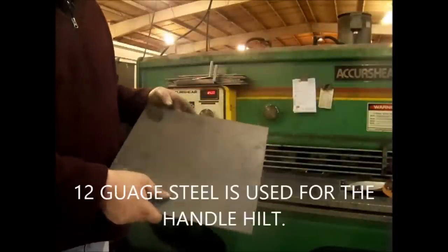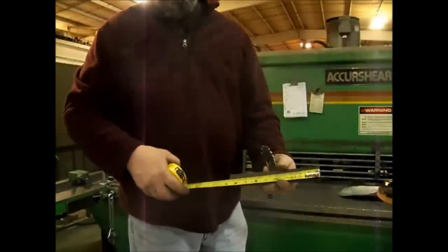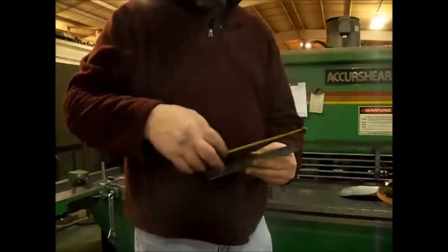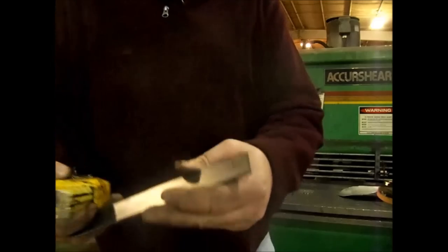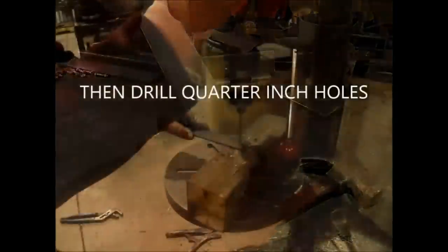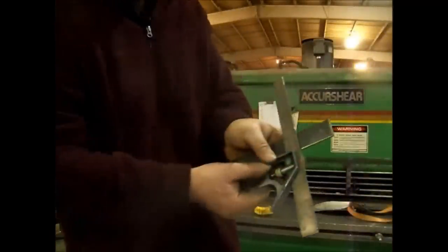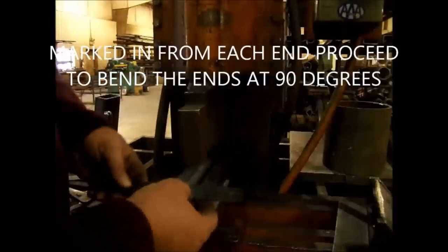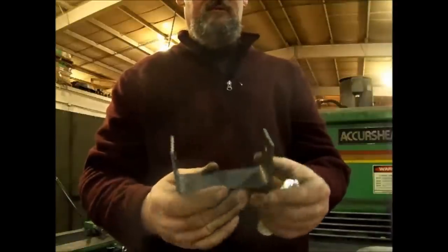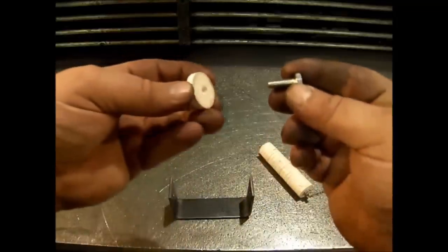What we're going to do next, we're going to cut this piece of 12-gauge steel into an eight and a half inch long piece by inch and one quarter. First we're going to want to measure in five-eighths of an inch from each end. Give it a good whack — that way the drill bit is apt to follow that hole. Then we're going to cut on both sides. It's time to measure two and one-quarter inches — use a square, mark it. With the mark, we're going to want to stick it in the press. When you're done, you're going to end up with the hilt for the shovel handle, just like the shovel behind you.